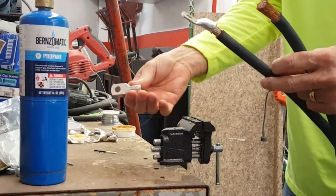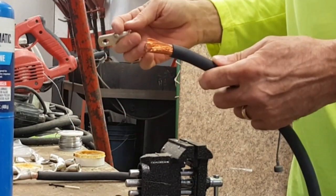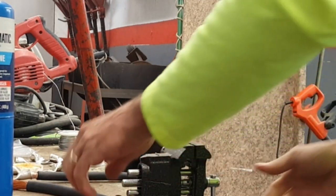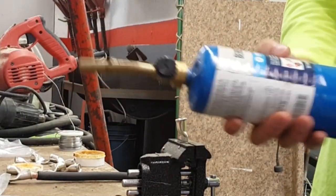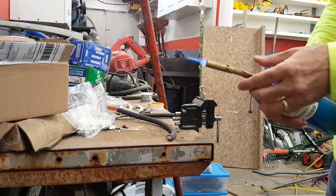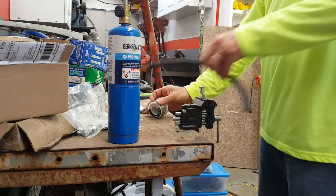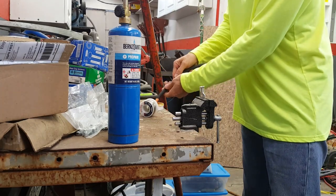These ends come like this. There are cable cutting machines and fancy ways of doing this, but I'm just an old-school guy. I've got a simple little vice here — a little three-inch clamp-on vice, very lightweight but it does the job. I've got some flux here and I'm going to do this with a propane torch I bought at one of the big box stores. I'll light the torch up — got a nice little pencil flame, a real narrow flame. I've got some electric solder, silver-bearing rosin core solder, and I'm going to strip off some insulation here about an inch using a razor knife.